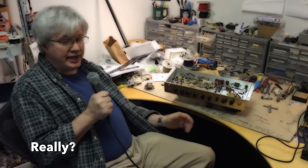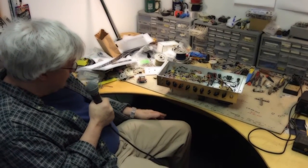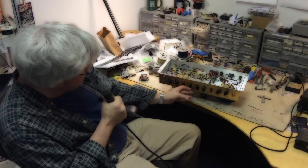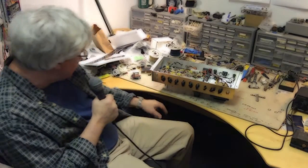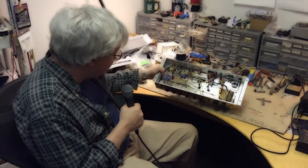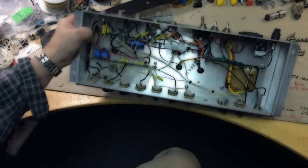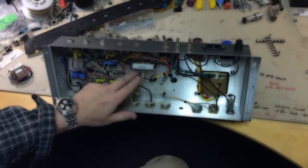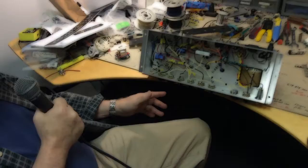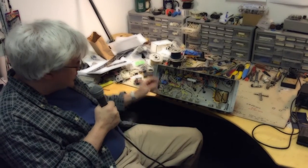It's been a couple of days, but I finally finished assembling the chassis I was showing before — the faceplate, the chassis, and the loose parts. This is what it looks like completed. The faceplate is held in place by the knobs and the pilot light. I had second thoughts about the green jewel — I'm going to go amber on this one. Input jacks. There she is: honest-to-gosh, old-school point-to-point wiring. My particular method is I use terminal strips, which I showed you a while ago — terminal strips, tube sockets. There may be some last-minute wire dressing. I've already tested it for noise, I've already tested it for output, and this thing tested 100% on the first try.